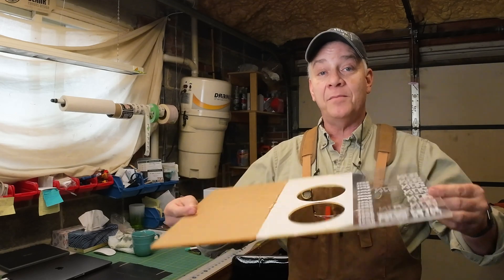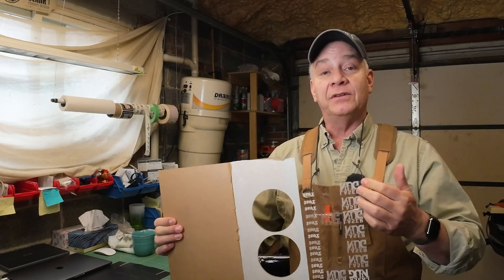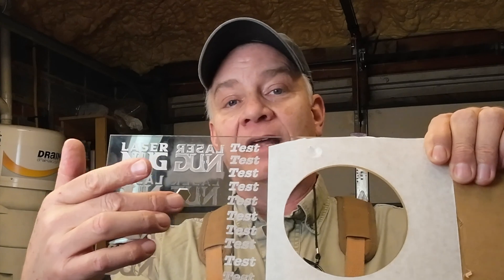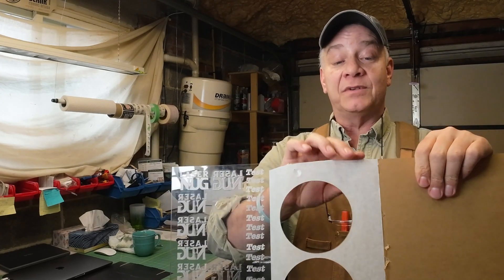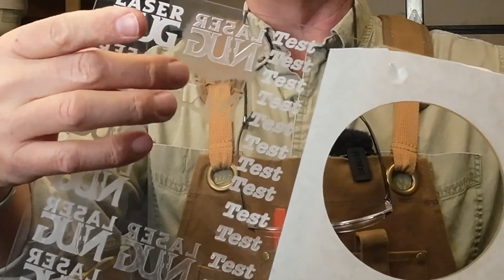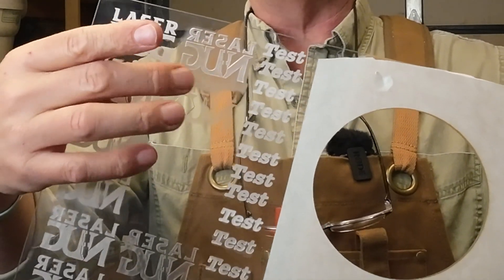The other thing the mask is going to save you from: some videos suggest you need to spray it down with WD-40, or take liquid dish soap and smear it on the front. The reason they suggest that is because when you're engraving acrylic, unlike many other materials, the residue almost sticks to the acrylic. That fine dust is very, very difficult to get off. I still haven't been able to get that off — I was scrubbing at these things for quite a while before I finally decided it was time to get my mask out. The mask works great. You'll have no residue, no cleanup.